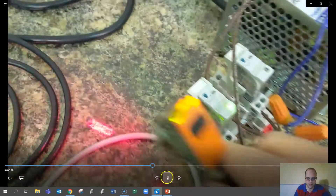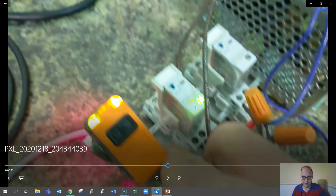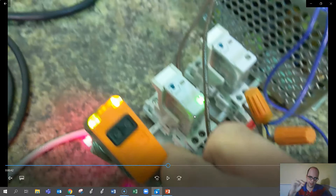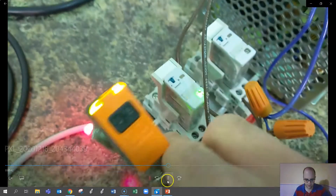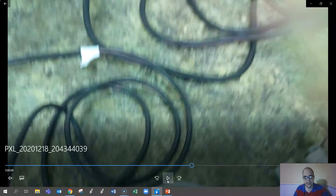You can see two different aspects: when the indicator light is on, the load is on because it's sending the signal. Sensors often have an indicator light showing whether they're tripped. If the sensor is tripped but the load isn't activating, you probably have an open circuit between the relay and the sensor. You can see both lights turn on at the same time — the indicator on the relay says it's been tripped, and the relay closes. That's how a PNP-wired photo eye works.